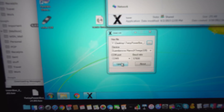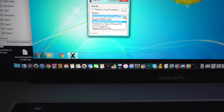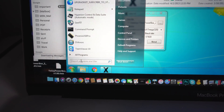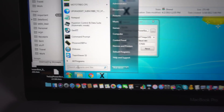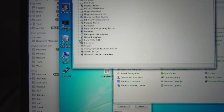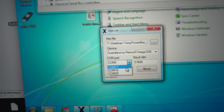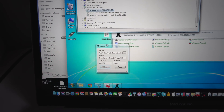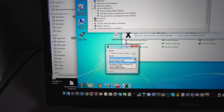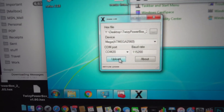It certainly can't find it on the port — this is a classic Windows problem. We don't know what COM port it's actually on, so you have to delve into Device Manager and find out where it is. So it's on COM 20. If we select COM 20 down here, it's showing Arduino Mega 2560.